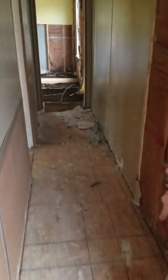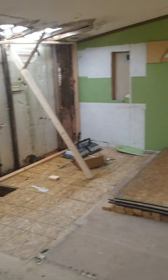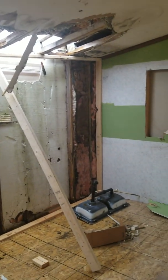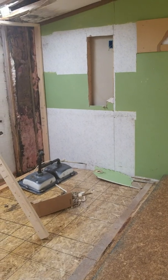That includes the materials here. We got enough OSB that I think we can fix this in here, and I think I got enough two-by-fours that we can probably frame up this wall. We might have to get some stuff for the outside — shingles, some OSB for the roof. The backside of the roof looks good, so what we're going to do is just patch the place and then go back over with a metal roof later. We're going to seal it up so that it doesn't leak, that way we can go ahead and get it rented and have income coming in, then go back with a metal roof in the next month or two when things aren't quite as busy for us.